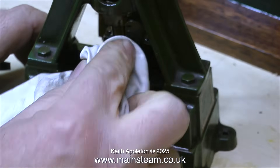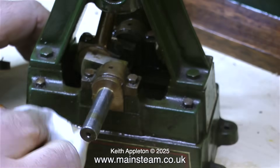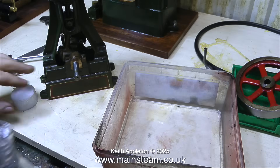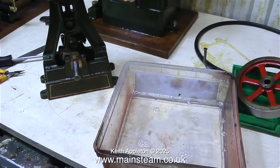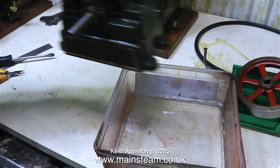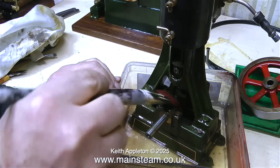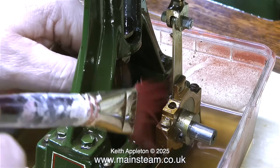Even though this old Stuart Number Four steam engine looks a bit horrible, it isn't - it's really well made. It was made by a proper engineer by the looks of it; the bearing fits are almost perfect and the flywheel is a very good fit on the crankshaft. The only thing I don't like about this flywheel, apart from the rust, is the color. I'm tipping quite a lot of white spirit into a plastic container. I normally use cellulose thinners, but in this case I don't want to remove the paint - the lining on the steam engine has been hand painted so I want to keep that. I'm using the white spirit to remove oil, grime, and any loose flaky paint, and I'm only going to paint the parts of this engine that need painting.